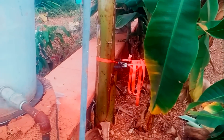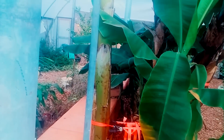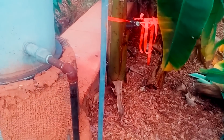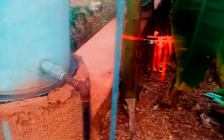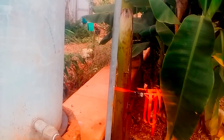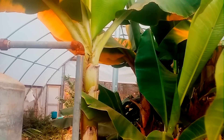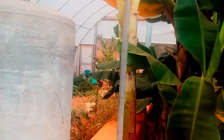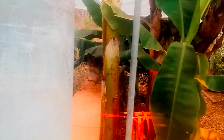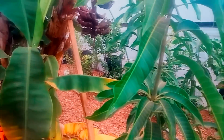That's a big, long bench. How long is the bench? About 25 feet. I added a backswing to it because the chimney was getting about 150 degrees. So I added another 10 feet by extending it, making a loop, coming back — added about 10 to 12 feet. Now generally the pipe is about 110, 115 degrees. So the rest of the heat is getting absorbed by the mass here.